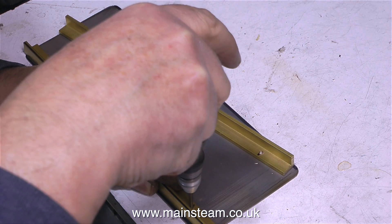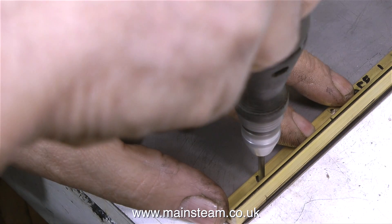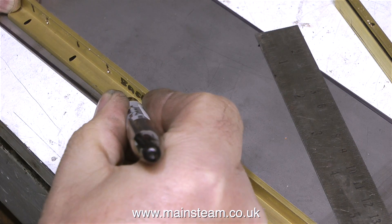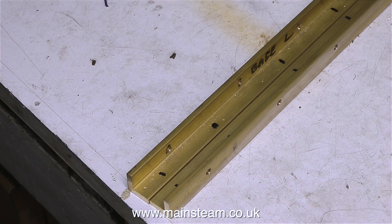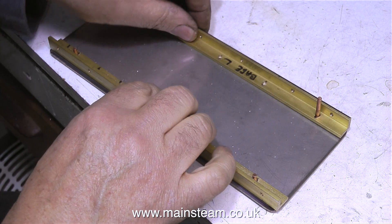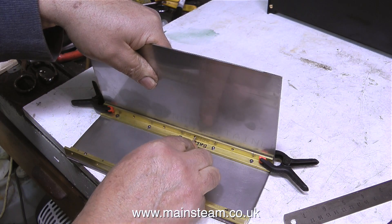What I'm doing at the moment is just making a mark on the metal plate, and once I've made the mark, I drill it all the way through in the drilling machine and pop a rivet in there. Then I make a mark through the hole with the Minicraft drill at the other end as well — this ensures that the brass angle is perfectly parallel to the edge of the plate. Before permanently fixing the brass angle, I drill some more holes freehand. I'm putting a felt tip pen mark in between the holes on the other side of the angle, using a couple of rivets to align the parts, then drilling the holes all the way through the steel plate using the brass angle as a guide. I riveted the brass angle using 8 rivets to the stainless steel plate, and now I'm using a needle file to mark the position of the uprights.